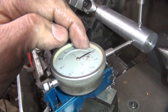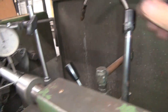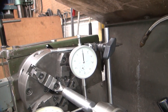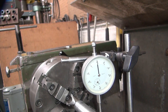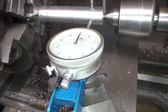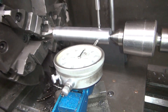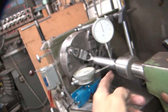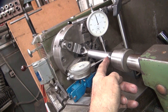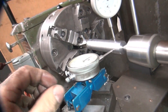So zero point — this one here is basically zero, this one here is about a half up. You're going to touch it, pack this thing all the way up, crank some tension on it. You can see how this thing goes up about one and a half to two thousand, and this one over here goes about one thousand. So that's going to take two thousand out of this, which will help us on being cut too small on this side.